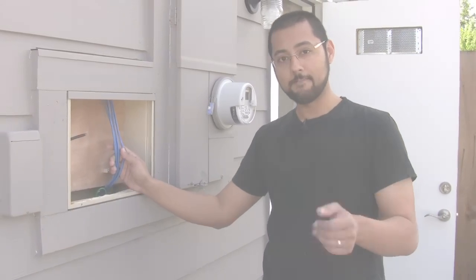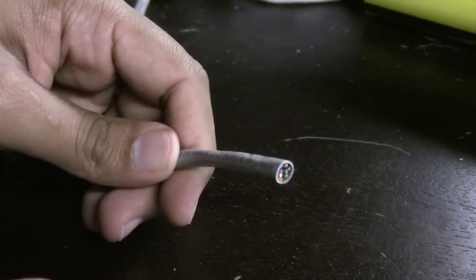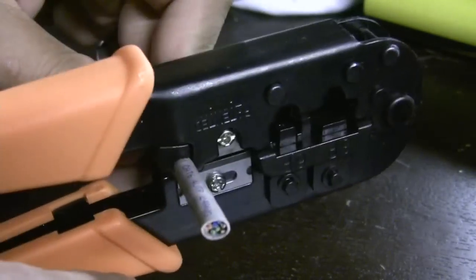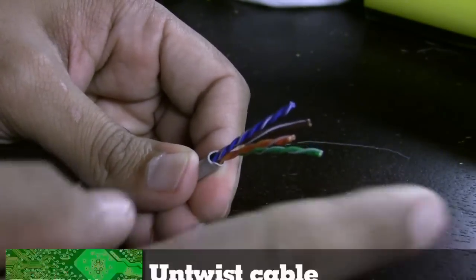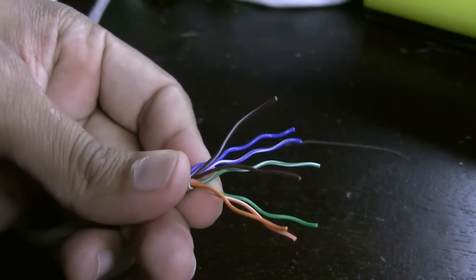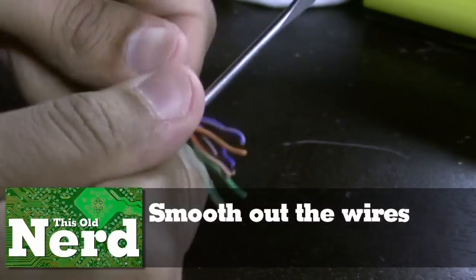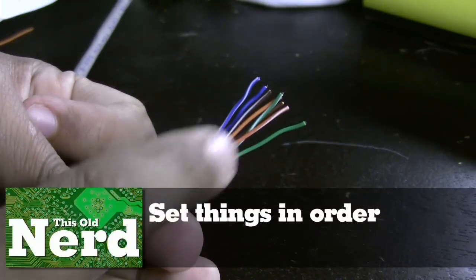How to actually put the end on this cable: we've got our cable and there are a couple of things we're going to have to do. Step one: unsheath the cable. Take your crimper — you can see it's got a razor — place the cable through about an inch, then turn the crimper to create a nice little cut, and rip the sheath right off. Now we have a bunch of twisted pairs we're going to have to untwist. The wires are pretty crinkly, so take a screwdriver and run the cables along it to straighten them out — this will help you pull the cable through the guide.